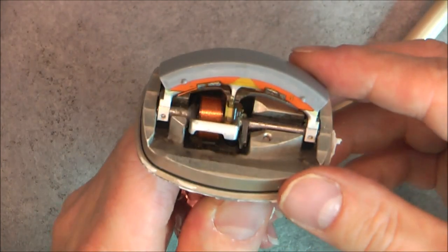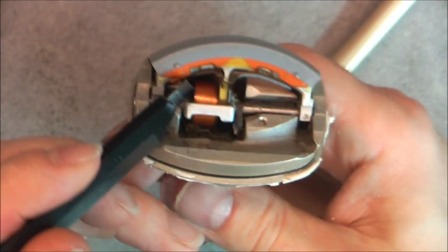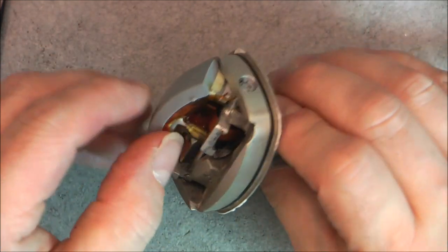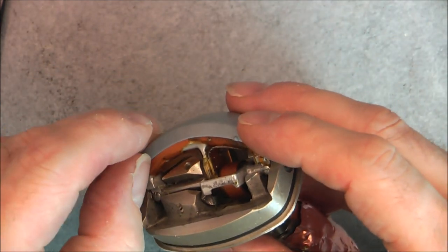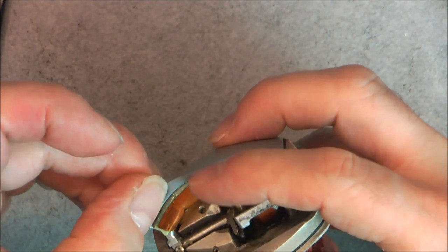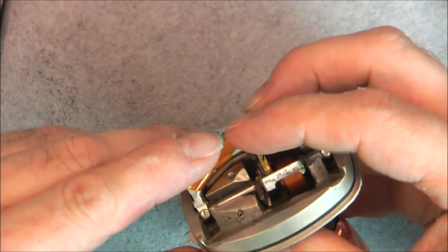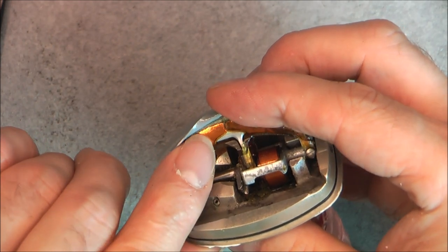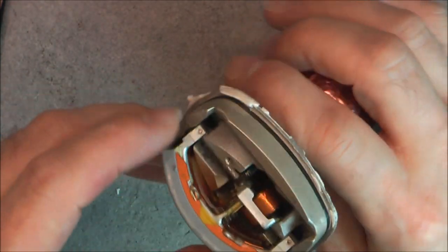So, apparently, we have this scanner head here. All the connections to it seem to be made here with a stack of flat flex. We have here some kind of skin, I will undo. No, it is glued actually. But yes, this is actually the connections to all the ultrasound elements, the stack of ultrasound elements, which are located back here. Probably a stack of elements with one or two connections each time made with this flat flex with a number of fine tracks. Same on the other side, or just ground return or something like this.